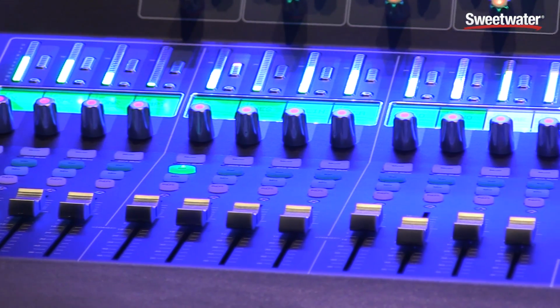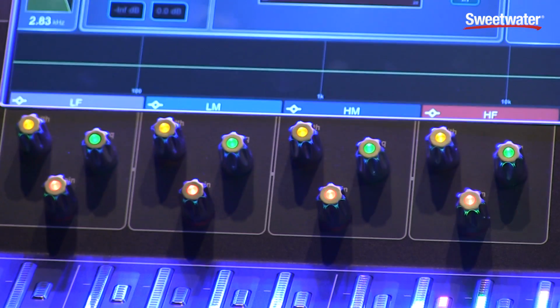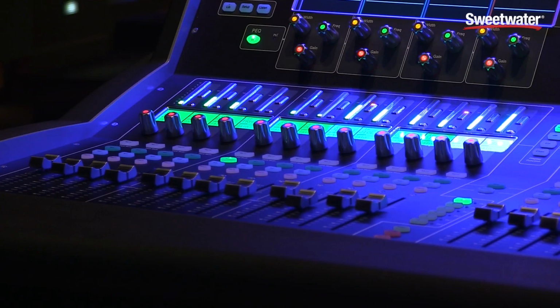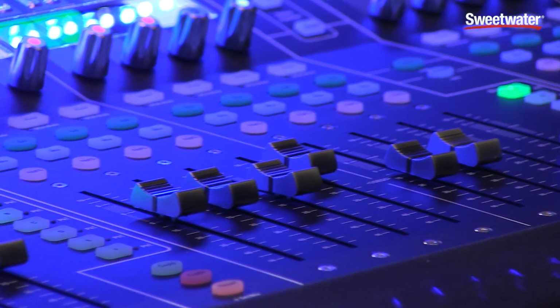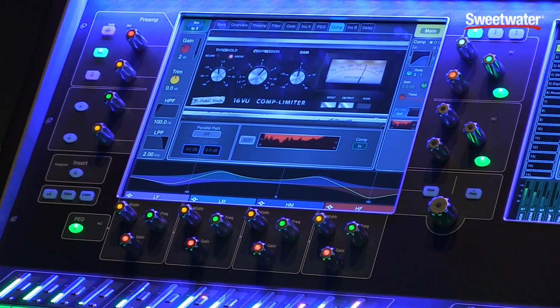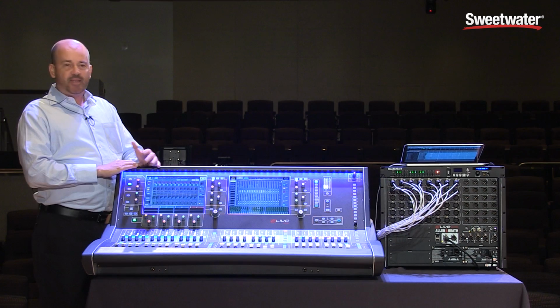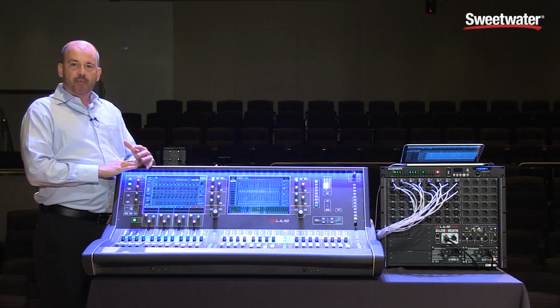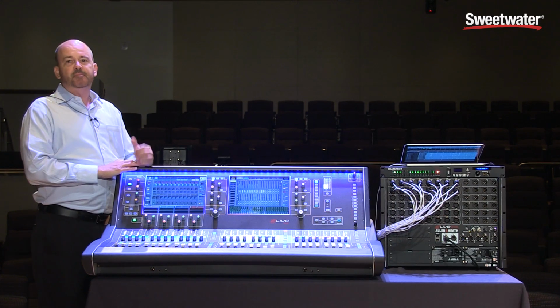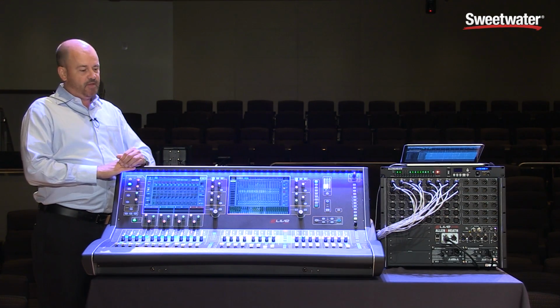dLive represents over 50,000 man-hours of R&D research with our team at our headquarters in Cornwall. We've done a complete ground-up build of our flagship digital mixing system, all housed around FPGA core technology. The entire system runs at 24-bit 96K throughout, has the capability of over 800 inputs and outputs with 160 mixable channels at one time over 64 mix buses.